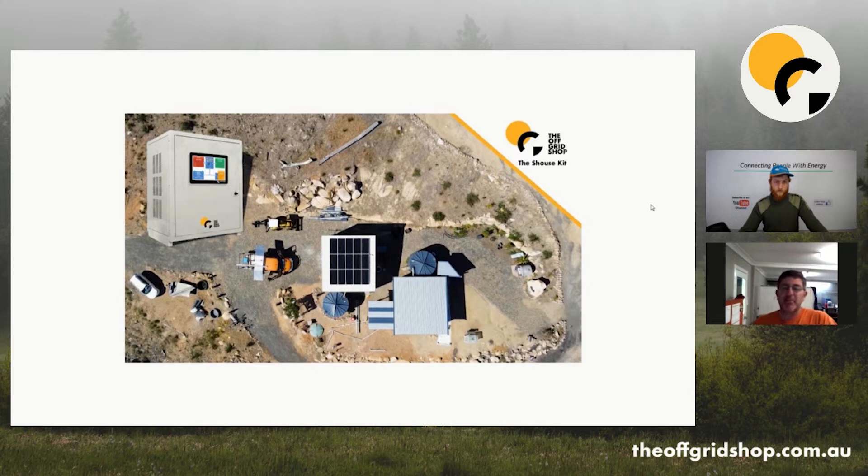It's very common and a lot of people do it. This system is designed all around — we use a 5kVA inverter and the Power Plus batteries. With this system, we put somewhere between 8 and 16 kilowatt hours of battery storage and somewhere between 5 and 8 kilowatts of solar panels. It all really depends on how much energy you want to use in a day.